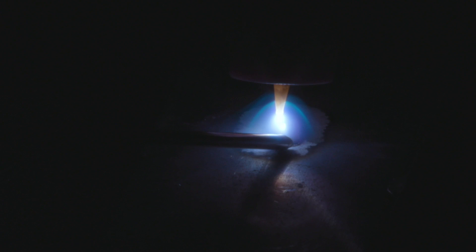If your puddle has already started but it becomes too wide, you didn't see that puddle established quick enough and now the aluminum is getting overheated and that puddle is getting much wider.